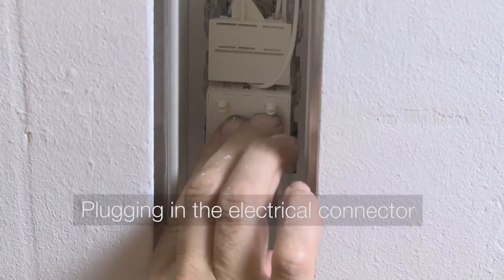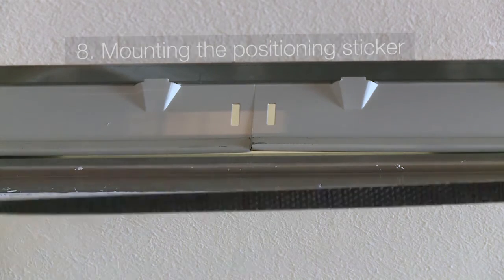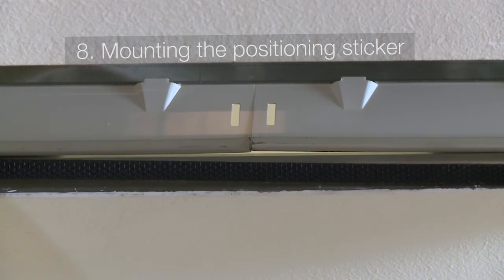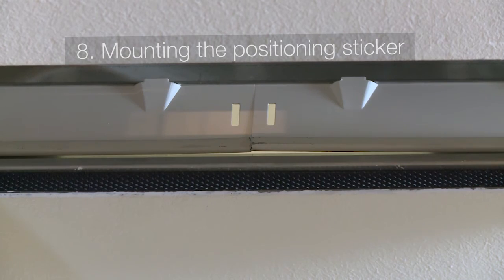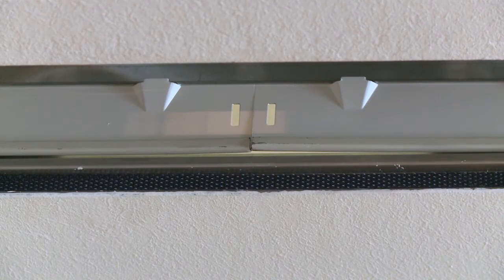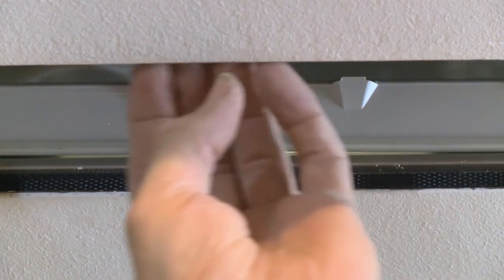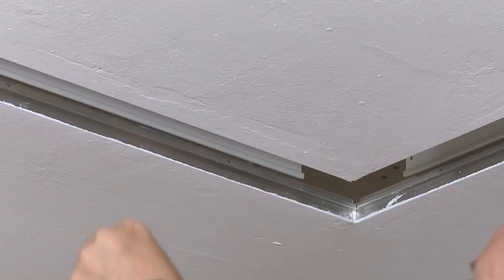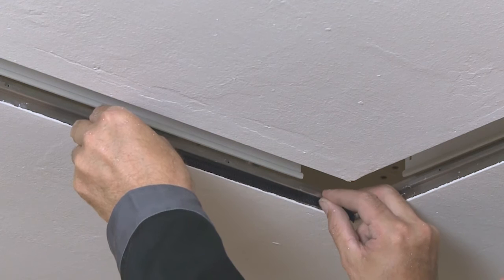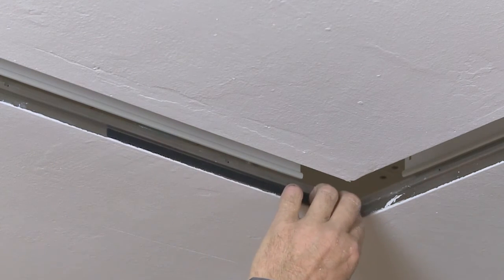The plug of the electrical connector has to be connected with the terminal plug. It is recommended to mount a position sticker in the middle of a linear configuration on each side of the plastering frame. This ensures a perfect thermal expansion of the optic equally in both directions. The sticker has to be mounted especially in corner luminaires to fix the position of the optic at the cut 45-degree angle.